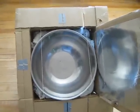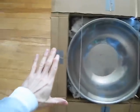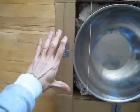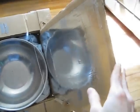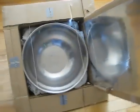I needed to figure out what angle to put the reflector at. First I took my solar cooker and made a point directly at the sun using my sun finder. Then I set the reflector at some random angle. What I found was the sunlight was being reflected to over here, which is useless — I want the sunlight reflected onto the bowl. So I gradually increased the angle, making it steeper and steeper until finally I had the sunlight on the bowl. But my aluminum foil was just taped to the cardboard so it was wrinkly, so it wasn't very precise.